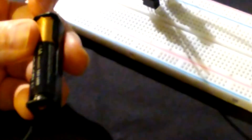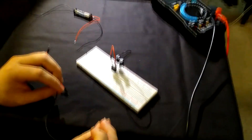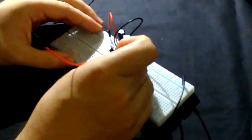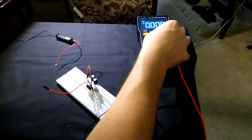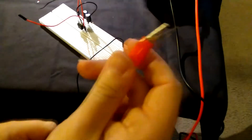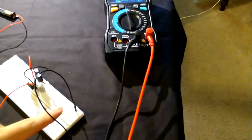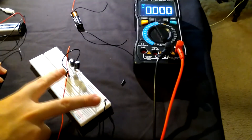Because I don't have a DC source generator, I am going to use batteries as input for this experiment. We need to measure the potential difference from the ground to the output of the linear voltage regulator. The red wire is going to measure the output voltage with respect to the ground. I am going to turn the multimeter on to DC voltage, connect the red probe of the multimeter to the output, and connect the black probe to the ground.